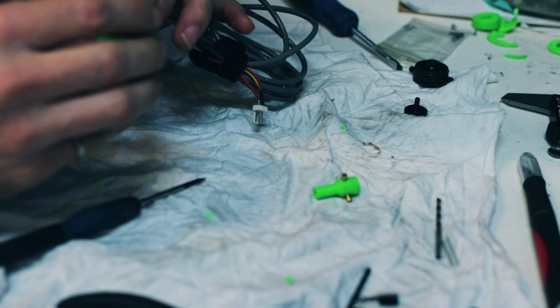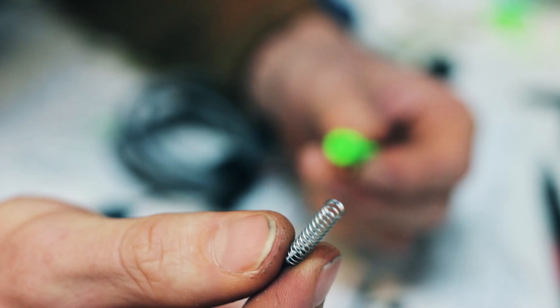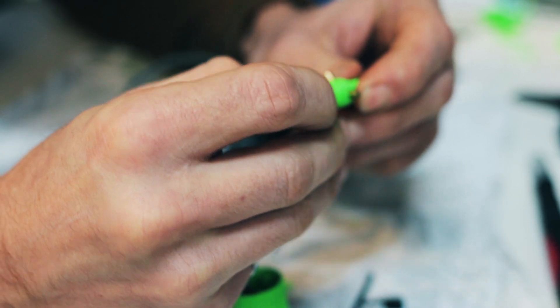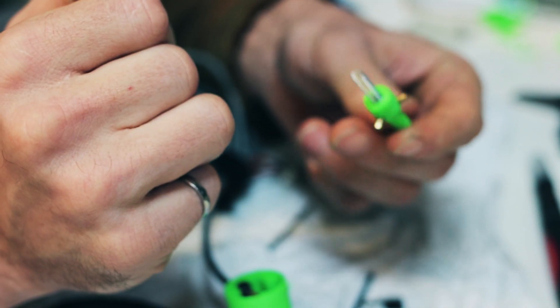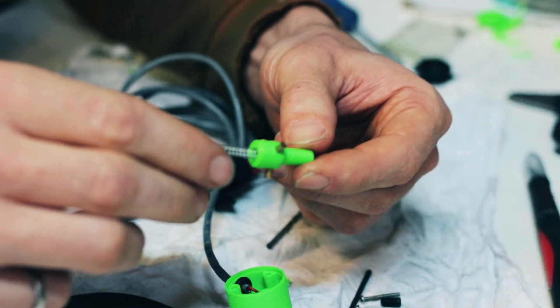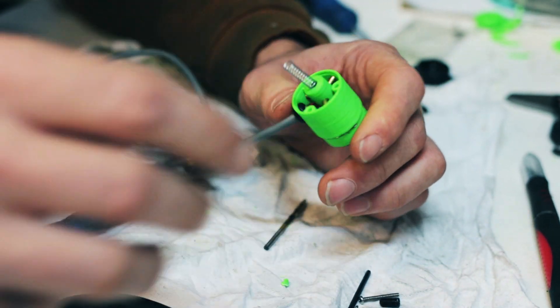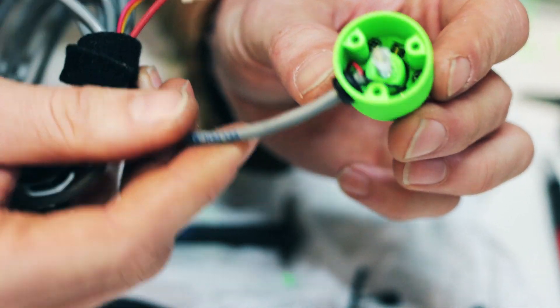The balls are all captured in there by the sandwiching action of these two pieces. The bare wires are sandwiched on both sides of that electrical break, making it a bunch of series contacts inside — which is why the probe works the way it does. Smart little system. I love this probe, especially now that I have a 3D printed one. This piece needs to go in and be pushed into those contacts. In the back side there's a small recessed hole for a spring — these just come out of pens. Push it in without losing it. Got our little spring in there now, sneak it past those little wires, and it sits in there just nice.